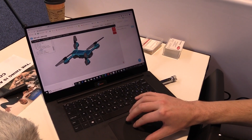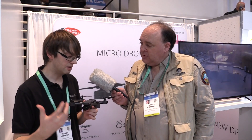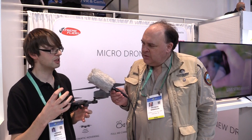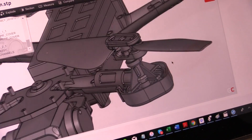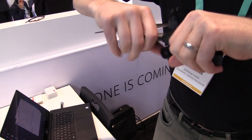The overall shape of the body has changed too from the prototype seen last year. We added some more structural elements into the body, one of which was motor holders. When we were testing the units we'd produced, if you crashed it too many times, sometimes the tolerances were slightly out. If that moved ever so slightly, it could cause some resistance in the drivetrain — something we didn't want on the final production model. To improve quality and longevity, we designed a little enclosure that includes the motor, the shaft, the propellers, and the gears all in one. We then strengthened that with two proper ball bearings — one on the top, one on the bottom. That's a single modular piece that clips onto the arm. That added a little bit more weight, which meant we had to slightly increase the size of the arms, but the advantage is much more durability and reliability. It also makes it easy to maintain if you need parts in the future. This arm is solid.